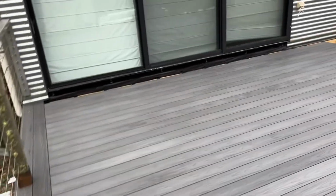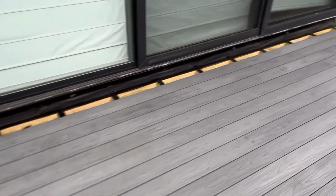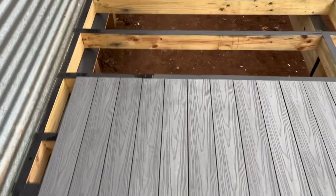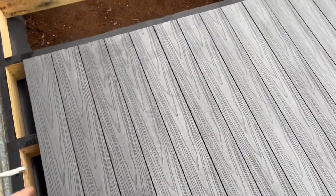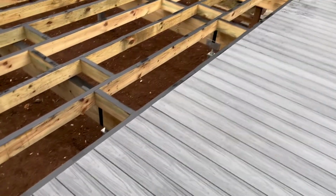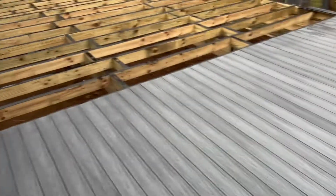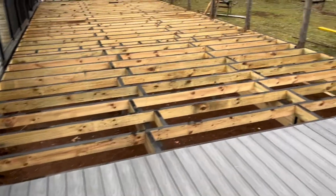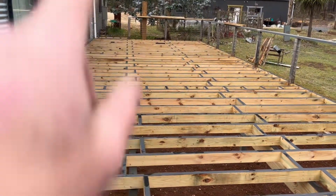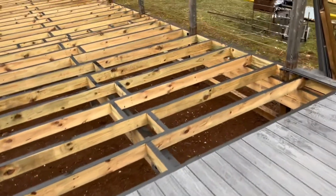I love that. So there's just one more board to go in there, but what needs to happen now is we need to take the end of all that off with a plunge saw, track saw, because we ran them long so we can get a nice laser cut finish, and then the two breaker boards, kind of like that, will go in there, and then we just repeat what we've just done today. There, then another set of breakers, there, another set of breakers, and then finish, and then the stairs, and then that's sort of the platform done.